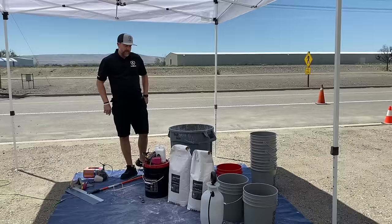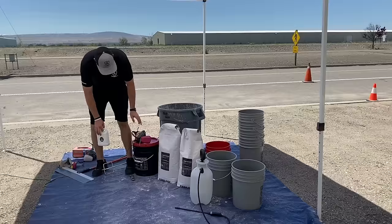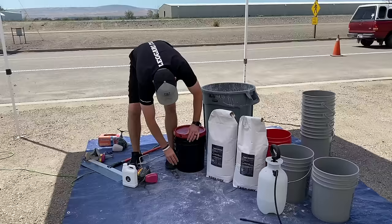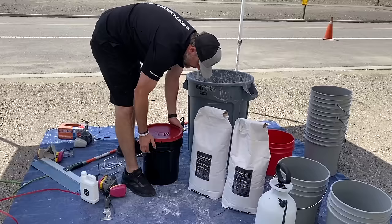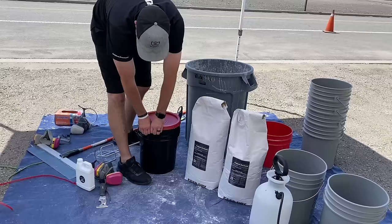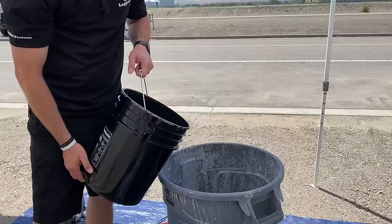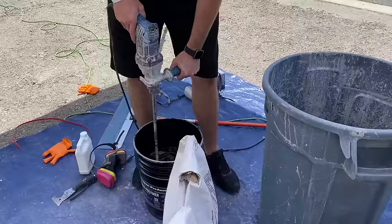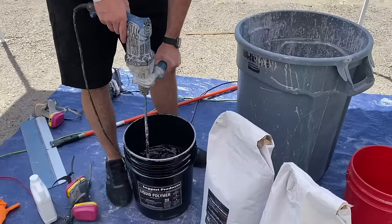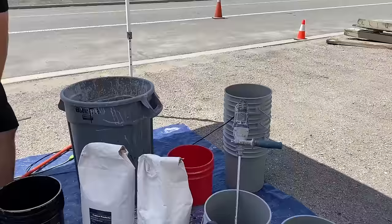So I'll go into how we're going to mix, and then I'll have someone jump in to pour the bags in for me. First thing we're going to do is open up the polymer and break this seal. Then we're going to dump half of it in, mix that up, and then dump the rest in — because sometimes the polymers will settle in the mix. So I'm going to dump half out, mix it up, hitting the bottom and the sides, getting anything that's settled. Also, a clean-out bucket filled with water makes it easy to clean out the drill. Now we can pour the rest in.